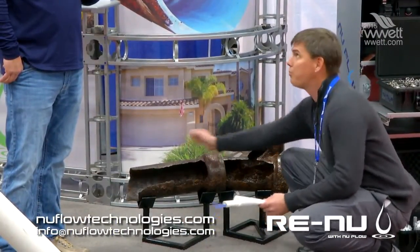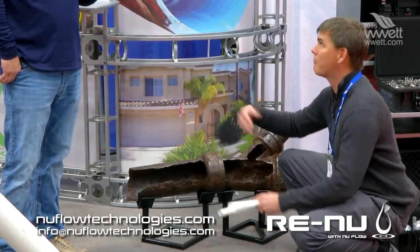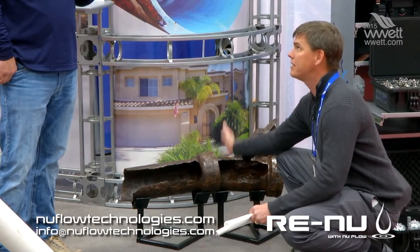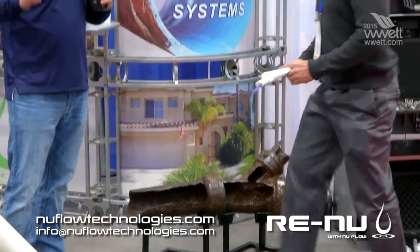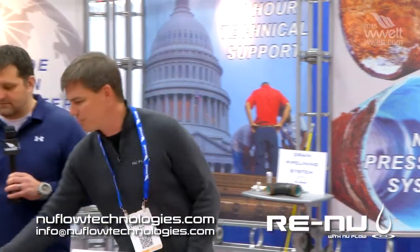There's no play in the middle — because it's inverting and you have to worry about expansion, or going around multiple bends. I can start it right where I want to every time. I can do this in copper, galvanized steel, cast iron, orangeburg, plastic — you name it, we do it.